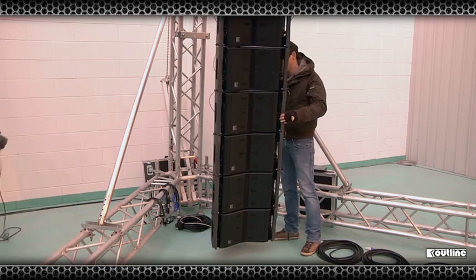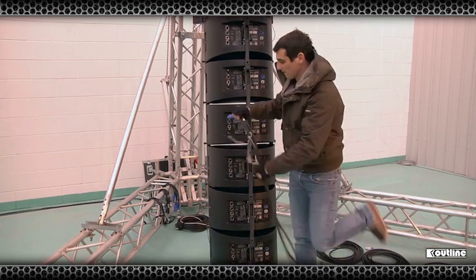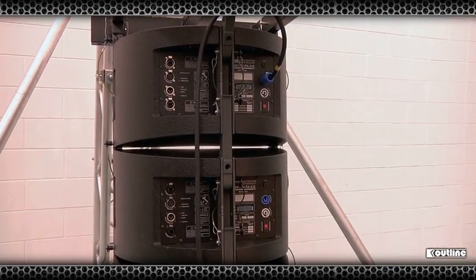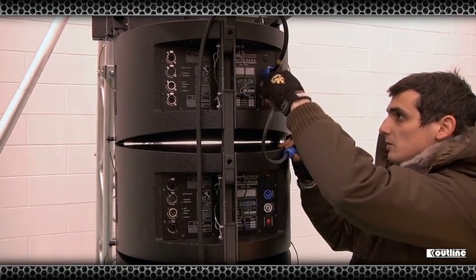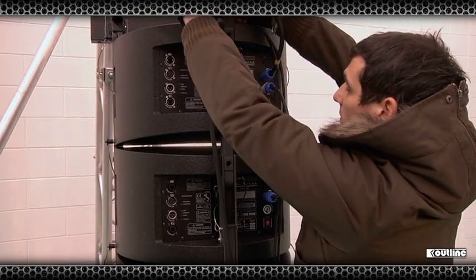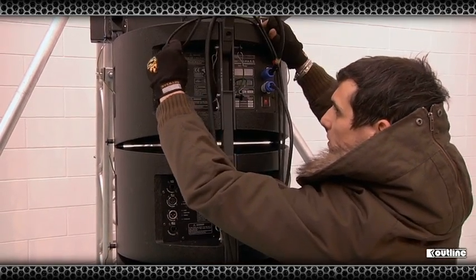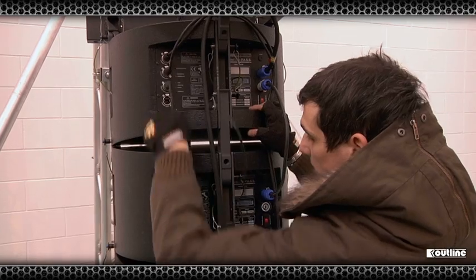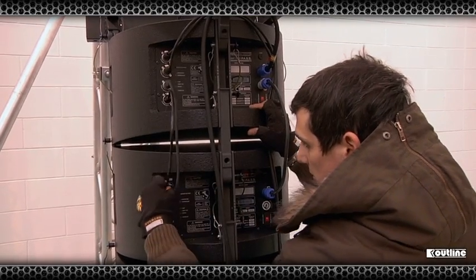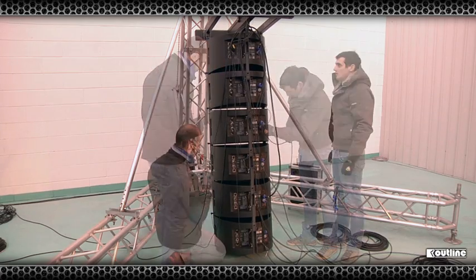Each Mini-Compass requires power, signal and data control. The mains power inlet is located on the right of the amplifier module and is in the form of a Neutrik PowerCon. There's also a power outlet to link to the next cabinet. Outline recommend up to three cabinets to share the same power source. Audio signal and data control can be found on the left of the module. Both have inputs and outputs for linking the cabinets. The signal can be paralleled to all cabinets or zoned as you see fit. Data must be linked to all cabinets if you want to remotely control all of the cabinets.